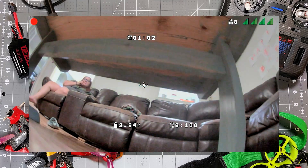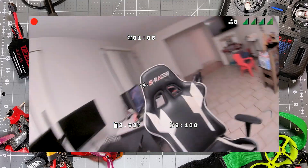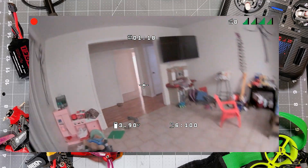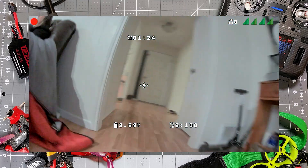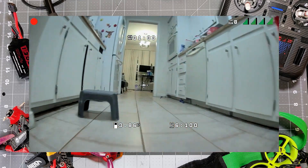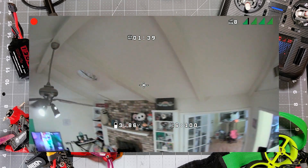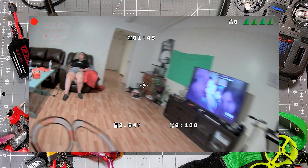I'm not getting any weird sparkle or breakup. Down on the bottom right I'm getting 100% signal quality consistently from this SPI receiver. It does come flashed with ExpressLRS 2.0 — a two-dot version built into Betaflight, so you can't flash it separately. It's good that they have 2.0 on there so newer firmware on your TX will still work with this SPI. As far as the tune goes indoors, it went really well — the stock tune is pretty good, though it could probably use a little tweaking.